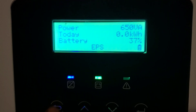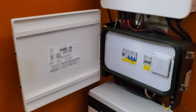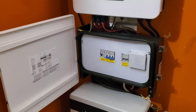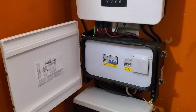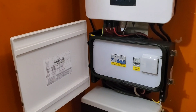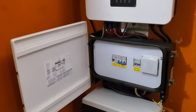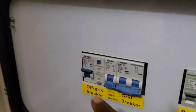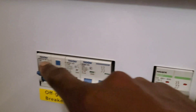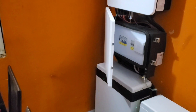The battery is finally discharging — imagine someone being happy about that! The changes we're going to make to the SolarX system: the residual current device will be replaced with a current limiter. I also need to find a way to get a breaker to turn off the power from the inverter to the house. There's currently a two-pole space in the panel and I need to find something separate that I can turn off independently.